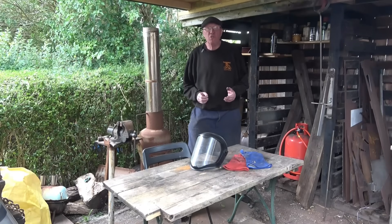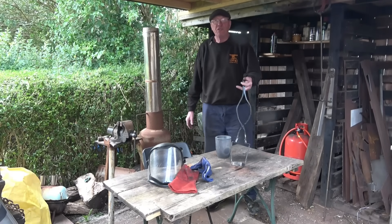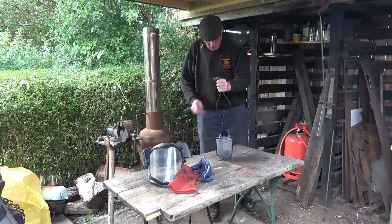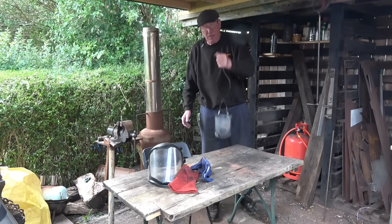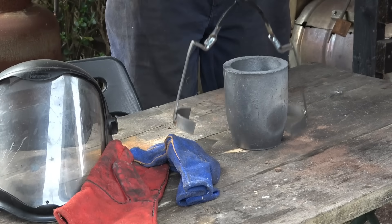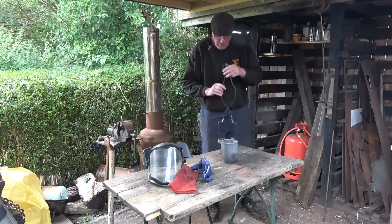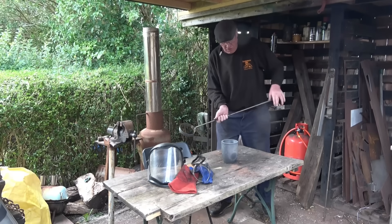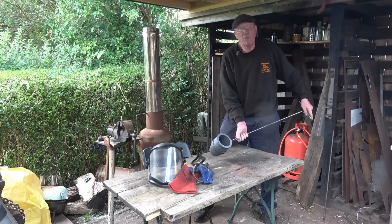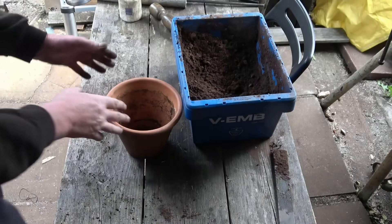I've made one or two tools to make handling the crucible a lot easier. I've done a lot of casting so I've got a rough idea what I'm doing. I modified the set of tongs that come with the melting furnace - you simply go over the top of the crucible like that, squeeze the handles together, and it lifts the crucible out. You can't put any excess weight on the crucible because the handles touch each other - that's perfectly safe. For pouring the metal, what you need is a pouring shank - really simple, a ring of steel on a handle. That goes on and you can pour the metal while in full control, supporting it with one arm.